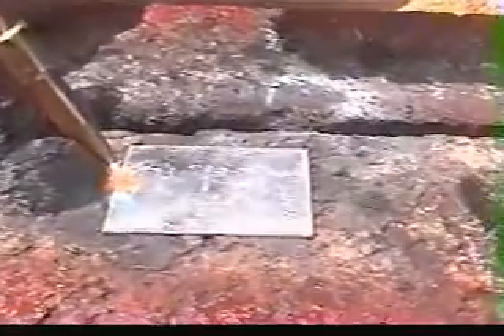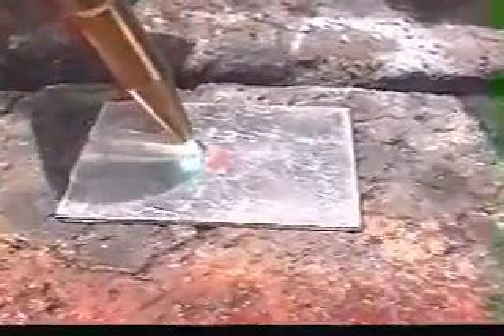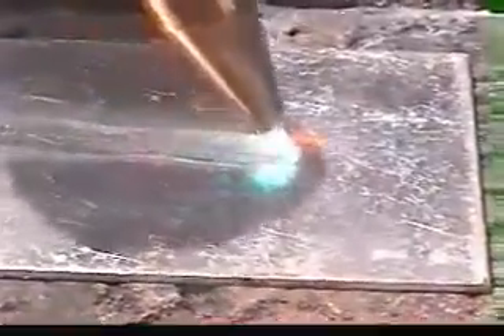This is what you're looking for when welding the aluminum — see the puddle. It looks like jello. If you get it too hot, it'll fall out the bottom. But that's what we're looking for: the puddle looking like jello.